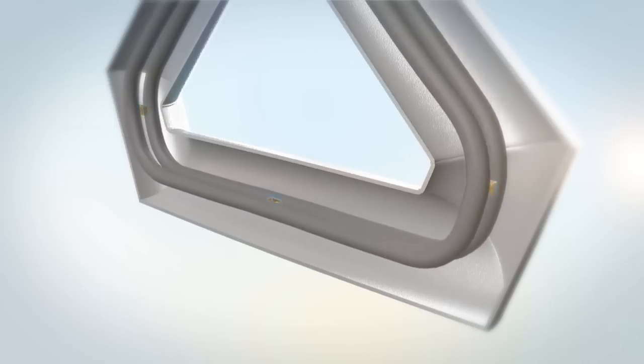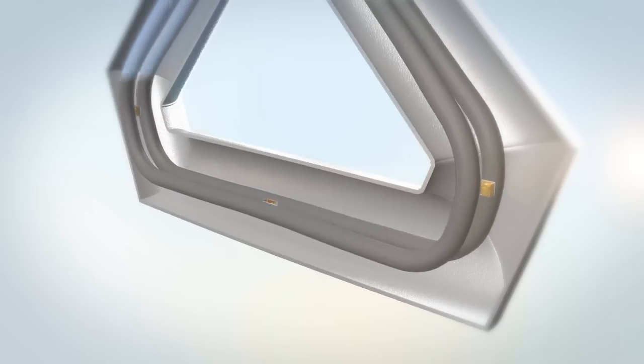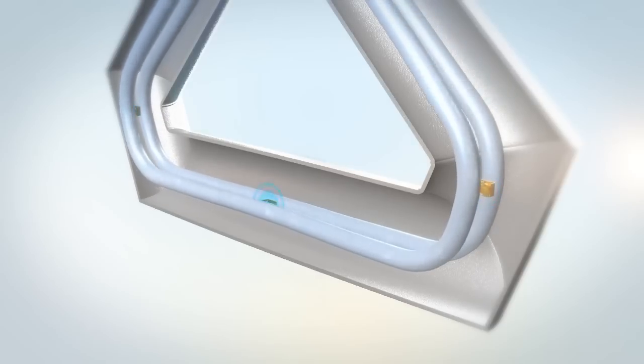When the fluid isn't flowing, the incoming and outgoing sides of the sensor tubes are synchronized with each other. When the fluid is flowing, it resists the perpendicular force produced by the vibration, causing them to twist in proportion to the mass of fluid flowing through the tubes.